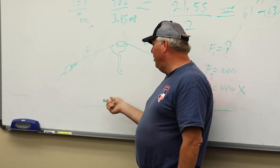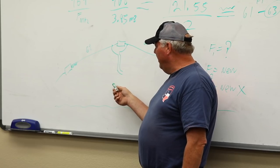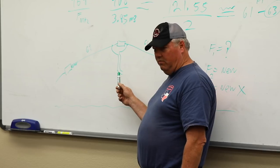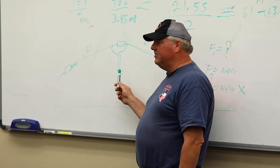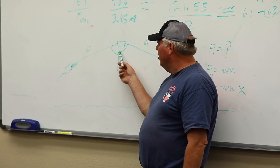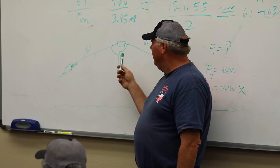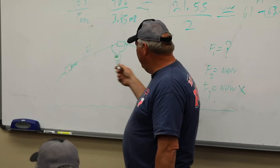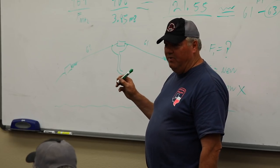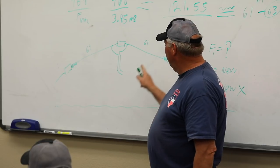And I did an experiment. I had my 80 meter antenna down at about 35 feet along with my 40 meter antenna, and they did work quite well. And then I decided one day to take my fat body and climb up all the way to the top of my tower, put an arm off to the side and a new pulley, and I redid the antenna system, and these wires are balanced within less than a quarter of an inch. I pulled them as taut as I could, or I laid them on the ground and got them as close as I could.